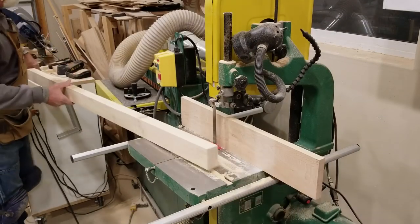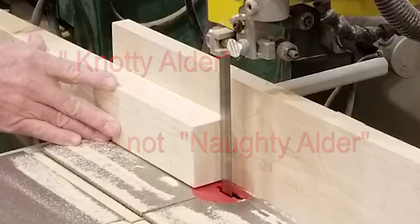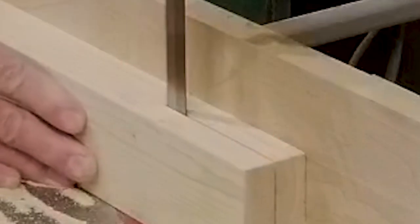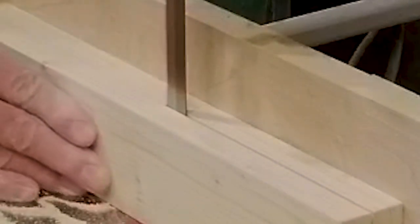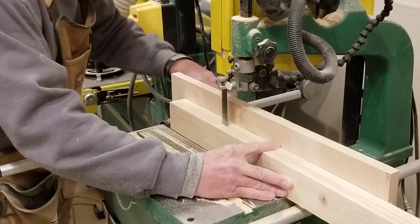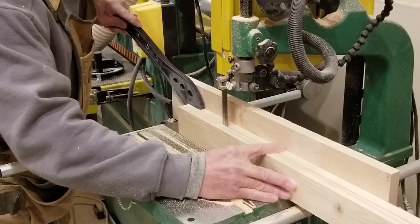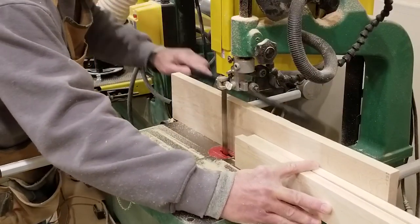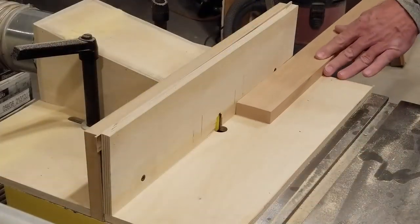The vanity and the towers are built from knotty alder. I have some pieces of alder that are inch and a half thick, which are referred to in hardwood terms as six-quarter — a dimension of wood that is six-quarter inches thick. Slicing the six-quarter piece in half gives me two three-quarter inch pieces of alder. The final thickness of the frame ends up about one-sixteenth of an inch less than three-quarters, which is perfect for the mirror frame.